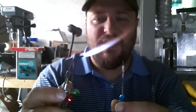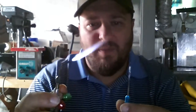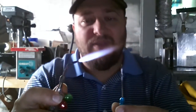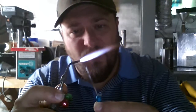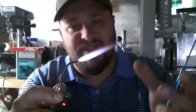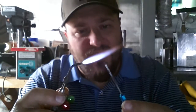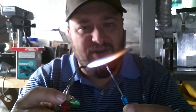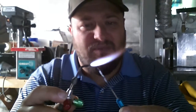What I'm trying to say is: don't feel like when you are using an open flame with a little bit of throttle that you have to use the little point inside the big flame envelope. You can every bit get the same result out here as you can back near the tip.